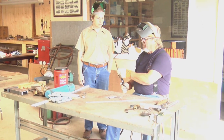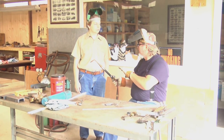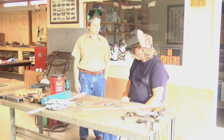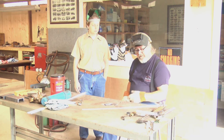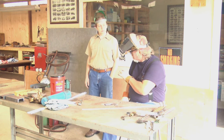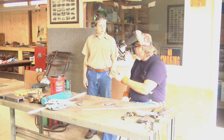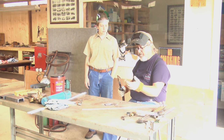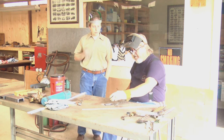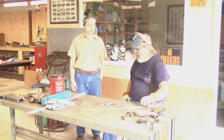When you're done, always turn your tanks and everything off. Now it's just like riding a bicycle — you learn the basics. You know the safety, how it works. Now you just gotta practice. Remember: 5 and 30 for cutting, 5 and 5 for welding, and just practice with your tip size. You need one tip a little bit bigger than this and it would flow right out.